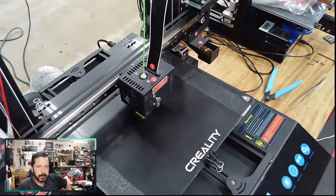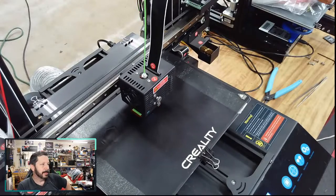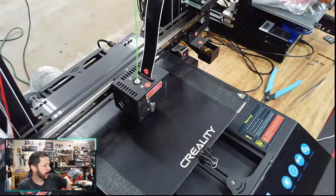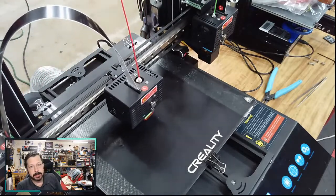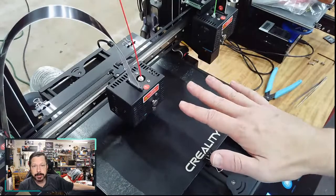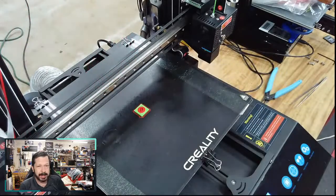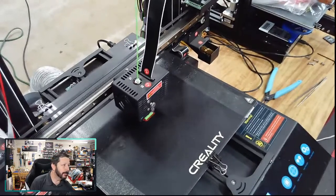Normally, when you do multicolor prints and you have a single nozzle, well, I was about to say common, but it's not really common. That's the more common, I suppose, way to do this. You have one nozzle and you feed different filaments into that nozzle. The problem with that is that those different filaments end up going through the same nozzle and bleed into one another. And so you have this lengthy purge area you have to deal with. Here, I only have 2. Actually, they do have some printers, I think, can't think of it, it might be an E3D printer, that has more than 2 of these nozzles, more of the 2 sets of extruders. I think it might have 4 or 5 of them even. I do not have one of those printers. Maybe someday I'll get one, but I don't do enough multicolor printing for it to actually matter, right?